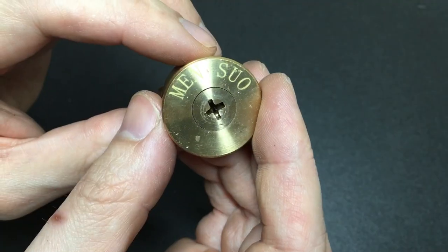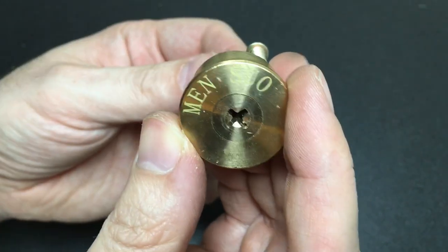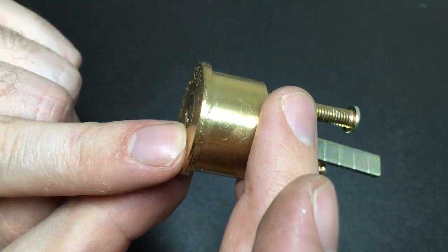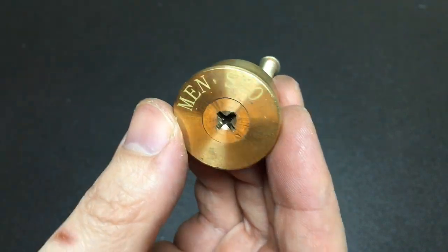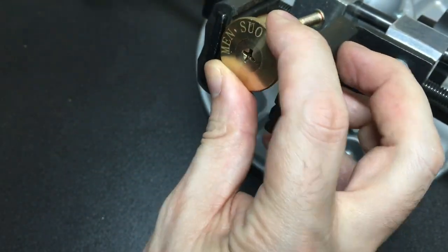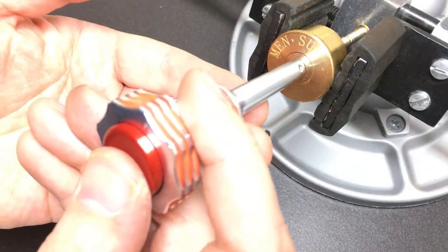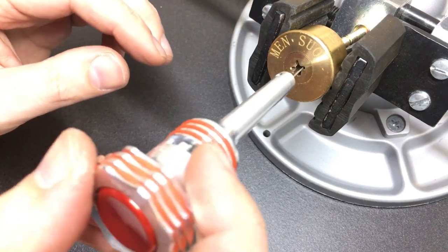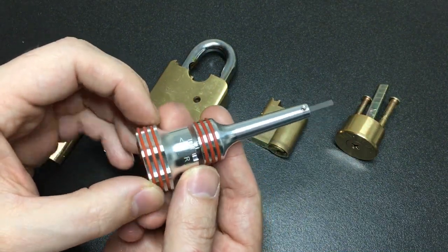The final scenario is cross locks. If you manually pick one position and turn it, it will eventually fall into the pin chambers on the next side, then the next, then the next. You can save yourself time by just flipping it round. These plug spinners do actually flip these locks — pop the tool centrally, press the button, and you can see the tail piece flip over. We've turned it to another position.